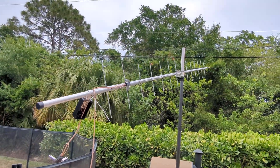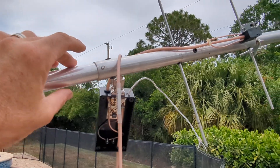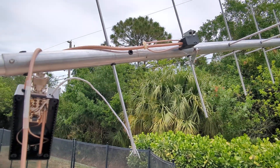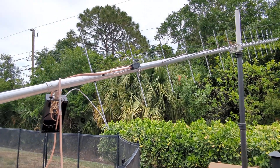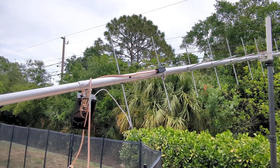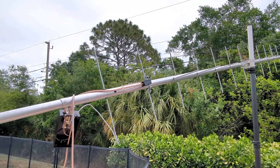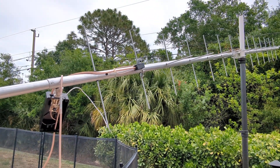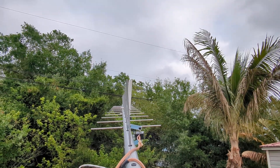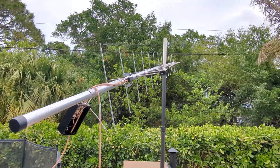Is that bad? At this point if I wanted to leave the elements where they were and drill new holes for the reflector, I'd be out of room on this pipe. I know some online calculators show a closer spacing for the driven element to the first director, or equal spacing. I don't think I've ever seen a driven element and reflector that close together — but what will be the disadvantage? I've built Yagis and cubical quads before that worked, and my antenna relies on your input, so comment below.